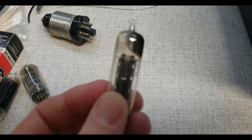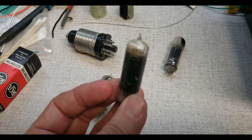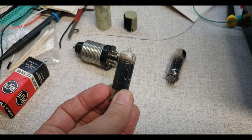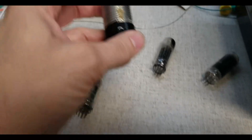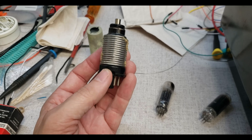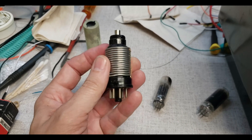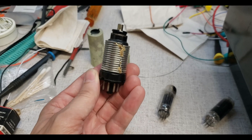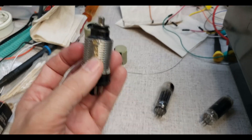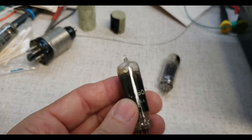I have the tubes out at the moment. This one is good, but unfortunately this beautiful old tube has died — it's a 6AQ5. I went on eBay and bought a new 6AQ5 to replace it. Interestingly, this appears to be lead solder that somebody wrapped around this tube and then ran a hot iron up the sides to melt it together — they made their own lead shield. This must be the high-gain tube for the recording circuitry and they were trying to reduce some noise.